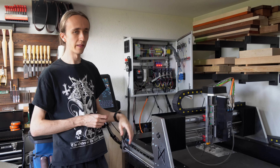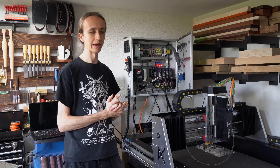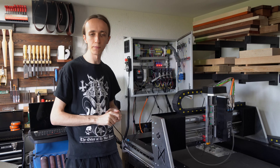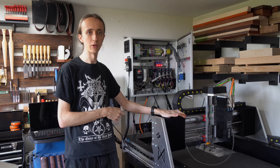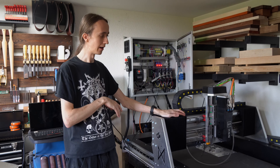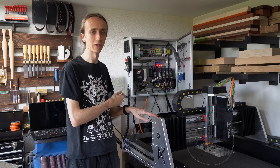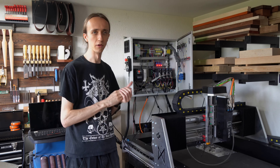To tune the servos you connect to the driver with a USB cable and load the motion control software on your computer. That allows you to change all the parameters in a more convenient way instead of cycling through the little buttons on the drive itself. It also has tuning utilities where you can manually tune using a scope that lets you see what you're requesting of the drive, what the drive is actually outputting, and the feedback from the sensors showing how accurately the servo is following the commanded position.